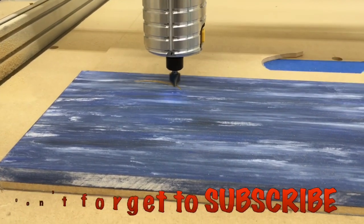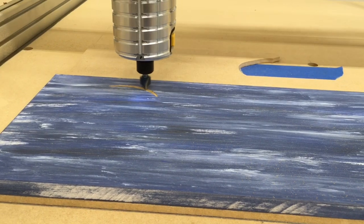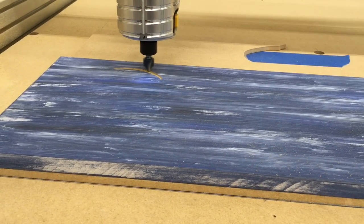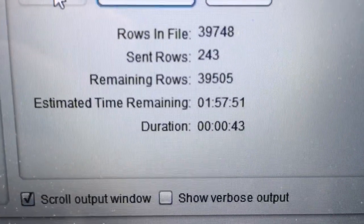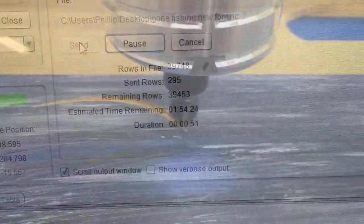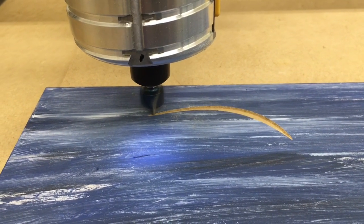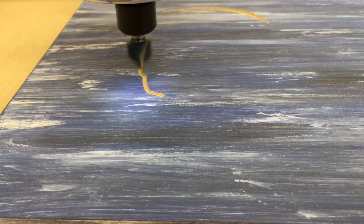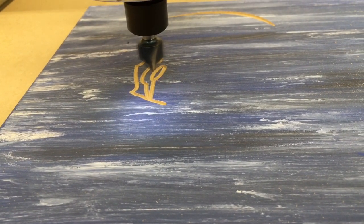Just as a reminder, this was an Easel file that was created in the Easel software and then was turned into G-Code in Easel and sent over to the computer, where we opened it in the Universal G-Code Sender. I've had so many questions about people asking about this. Now as you look at the estimated time, it's showing just under two hours to do the carving with the G-Code that was created with the Easel software. If you look at the first video of the Gone Fishing sign and compare it to this one, the first thing you're going to realize right away is that the toolpath is significantly different. You're going to see a lot of additional wasted movement where the machine is traveling from one point to another, and that is typical of the Easel software.